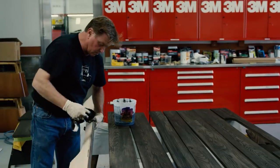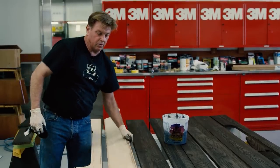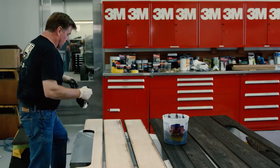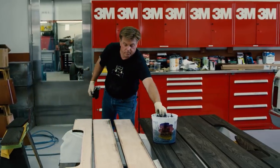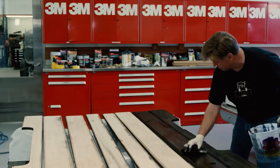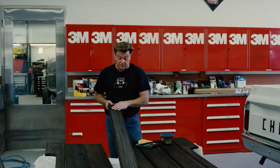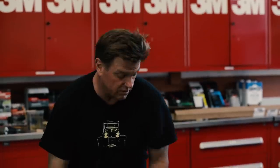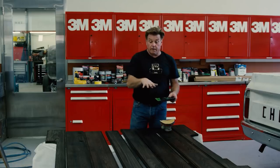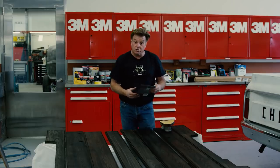The back is all done. I'm going to flip these over and do the tops. Now the fun part is, everywhere I hit the wood with the chain, the black is going to absorb into that and stay real dark in that hole. Because I used acetone and automotive paint, that stain is already dry. What I'm going to do now is take a fine sandpaper and with the DA, I'm going to sand the top of this real light. The little areas I hit with the chain will stay down low and stay dark. Then I'll give it another coat and those areas will get darker — it should look a little bit older.